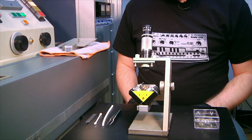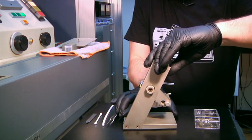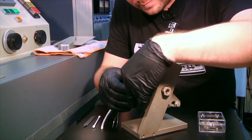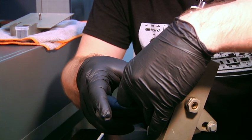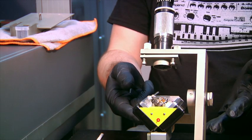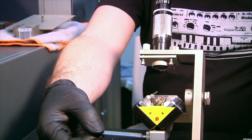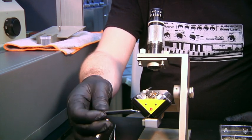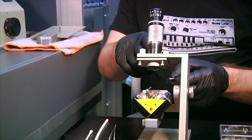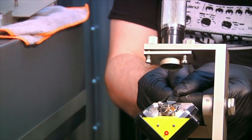Right now I was set up to cut lacquers, so I'm going to be changing out from a sapphire stylus to one of my diamonds. I'm going to turn this a little bit to get the heater wires off. For Neumann users, you get a specific insertion and orientation tool. Other users with Longshank Prestos won't have to go to this extreme — you just unscrew the holding screw, remove the old one, insert the new one, and screw the screw back in, making sure it is oriented appropriately.